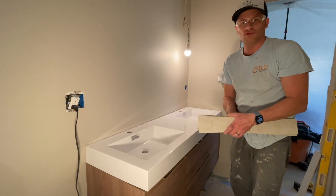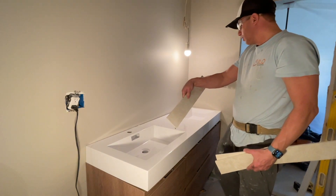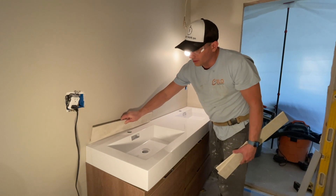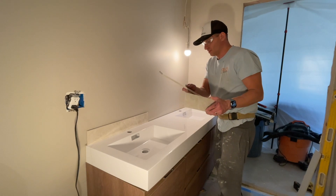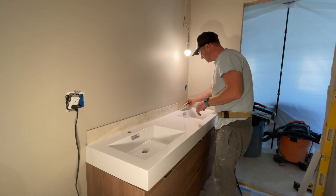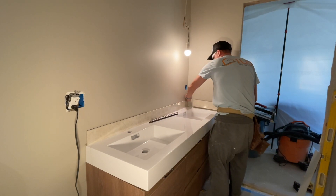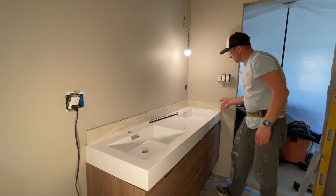So I cut my tile. I'm doing three and a half inches on tile and I'm going to place them in accordingly. These are 12 by 24 tile, and I'm going to leave the finished, not-cut side up high. So I'm going to plop them in like so. I'm also not going to have a big grout line — I'm probably going to go a thirty-second of an inch on the grout lines. That's the back, and this is the side. And that's the Jolly.